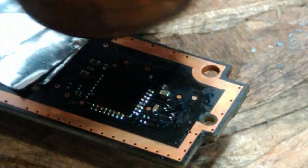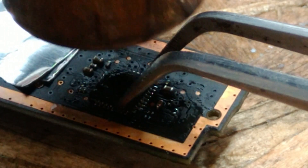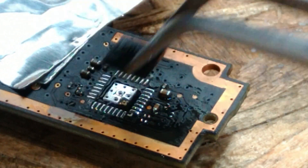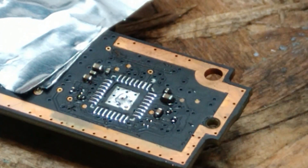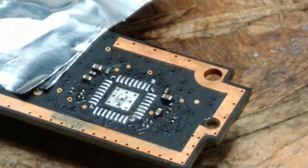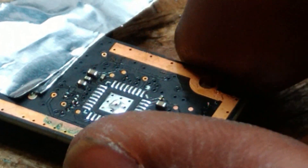It's not moving yet. Okay, let it heat up here. Okay, there we go. So this chip is up. Now we'll put it back in place and switch on the machine — see what happens. There is no bridging.